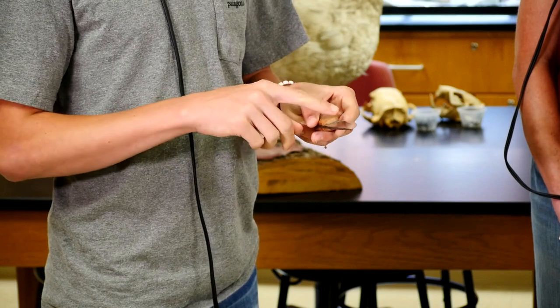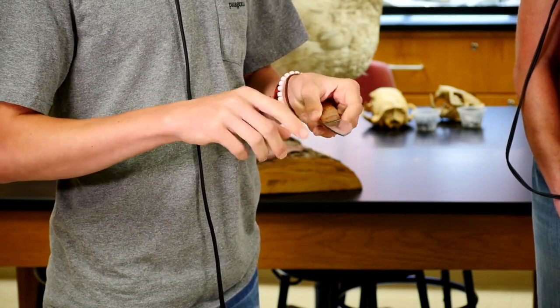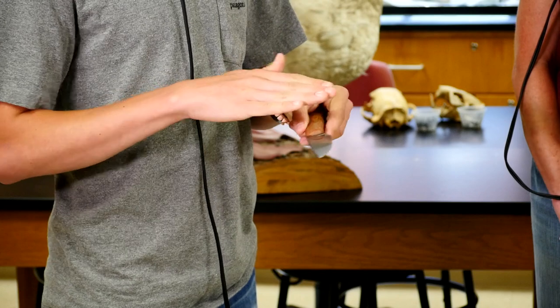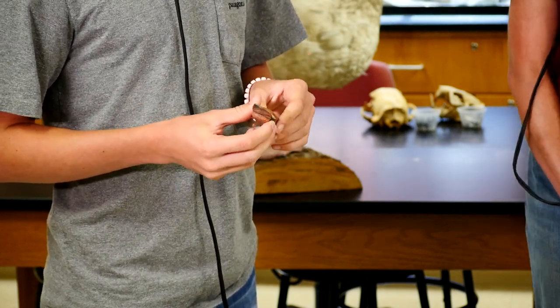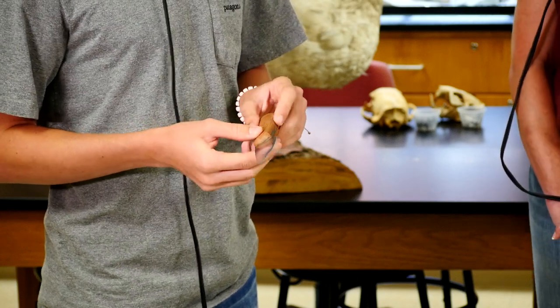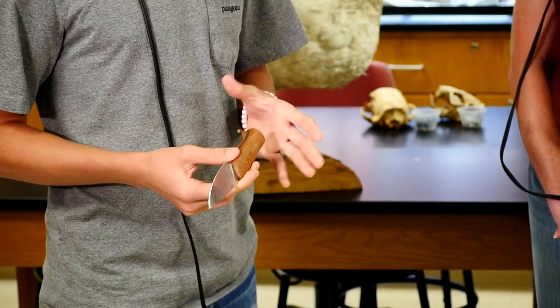So you want to make sure you have no longer straight scratches. And then you'll just go back and forth alternating. And this one is up to, I think, 800. So you've really got to work your way up, and it takes quite a few hours of that, the most tedious part.